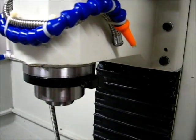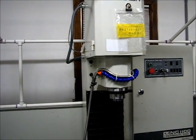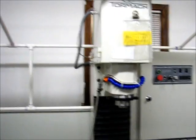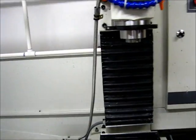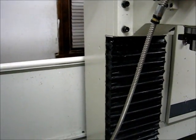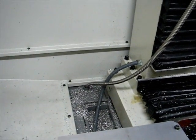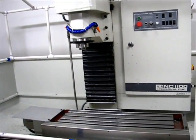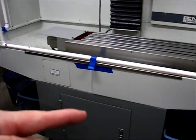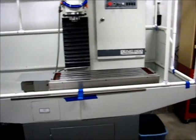I tried to design it with future modifications in mind — specifically a tool changer and a power draw bar. I can't think of anything that would interfere here. The coolant system I'm going to do next, which is the reason for this enclosure, may have some planning issues. I plan on putting the tool changer which connects to these bolts right here. The coolant will come up the backside and through. I think I'm going to bypass that port there to protect from leaks, since that area isn't necessary. The space underneath where the coolant tank is kept will only be used for coolant return.